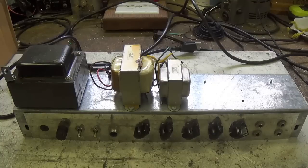Well, after doing some research on the internet and checking past correspondence with the owner of the amp, it turns out this is a Victoria clone of a narrow panel 5F4 Tweed Super Amp, model 35210. Apparently they identically duplicated the 5F4 circuit with the addition of a bias trim pot and a couple test points. This chassis came in a cabinet with two 10-inch Eminence speakers and cost around $2,800.